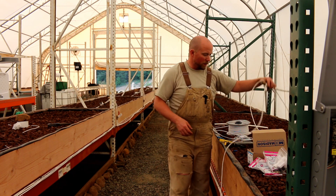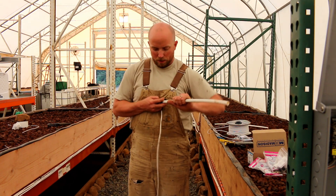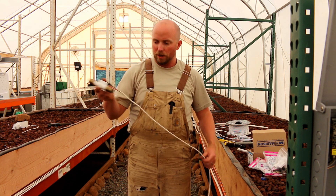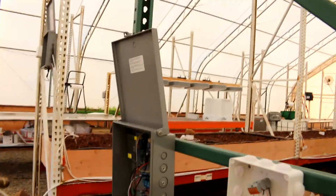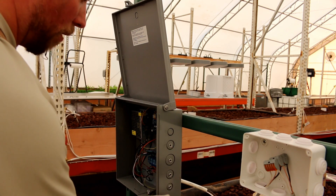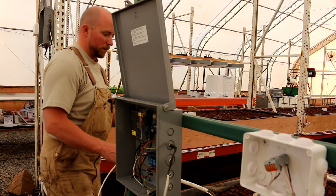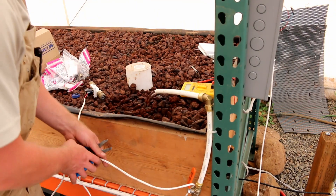There's that started. What we're setting up is the valve. And I'm going to take another good reason to love PEX — shark bites, just take that off. This is the removal tool. Make sure of this: there's a little arrow on the valve. If you've messed around with valves, you know about the arrow — you got to make sure the arrow's going the right direction. The only design mistake I appeared to make on the boxes, other than the mistake on the board, is that I put the valves on the wrong side. I put them running down the middle of each lane rather than on the same side. So I just need to run the wire underneath like this and bring it over. I need to trim that and put enough slack in there — a little loop gives me some assurance.